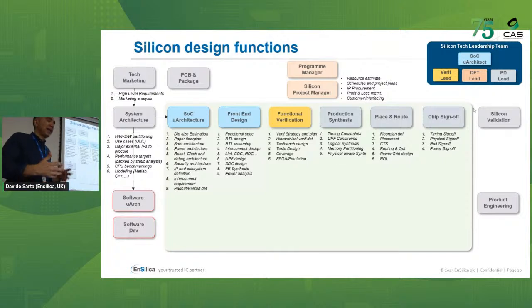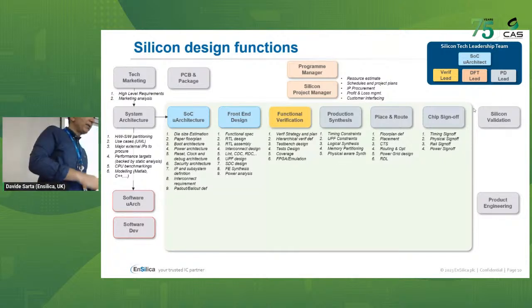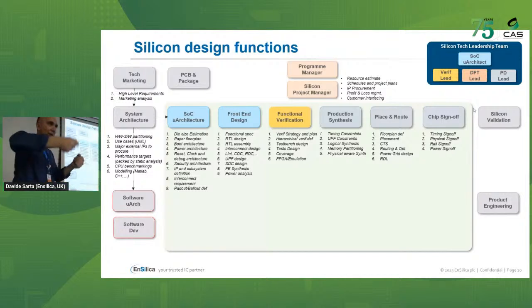That is a difficult one to do, but usually 10%, 20%, you assume that all the nets within your design, or the primary nodes of your design, will switch at that probability with respect to the clock. And that will give you a rudimentary idea of your overall dynamic power. And you can also have an idea about the leakage that your block or your SoC will consume. And again, it doesn't need to be precise. It cannot be precise at this stage.